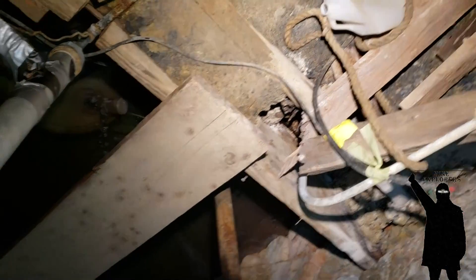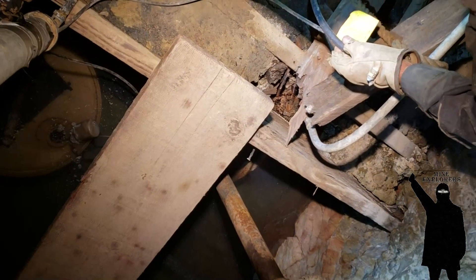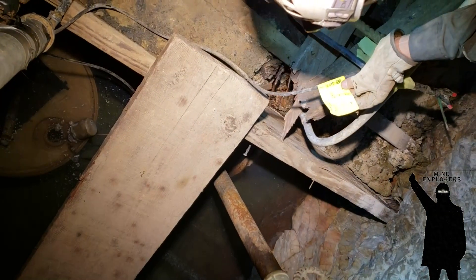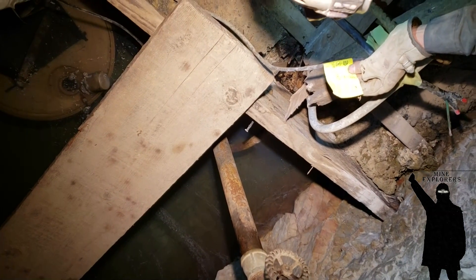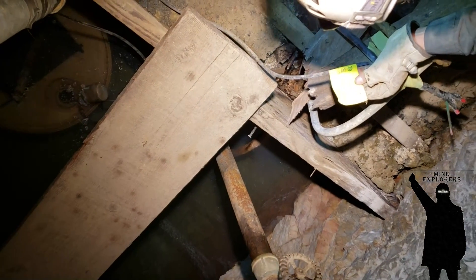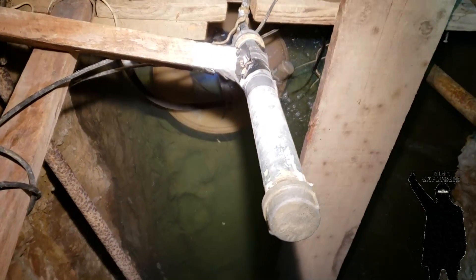What does that yellow tag say? That's the rating for the wire. 'Junior Super Single Pump Switch, 7/20/1989.' That has got to be a low water cutoff — a pump switch. So if it runs out of water it cuts the pump motor off.